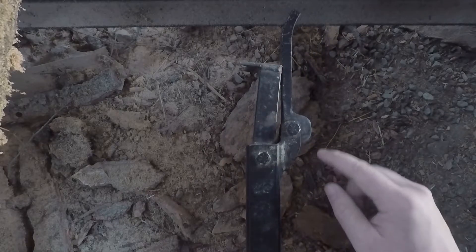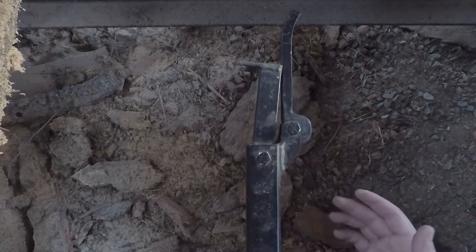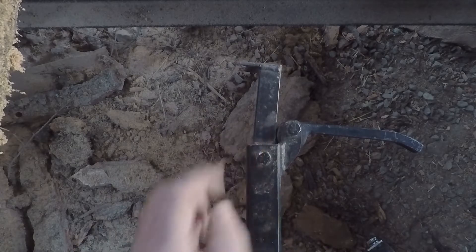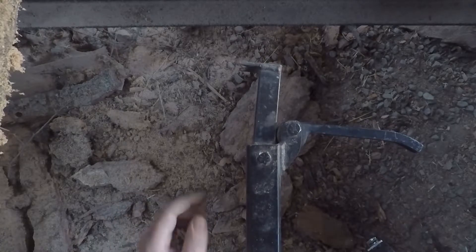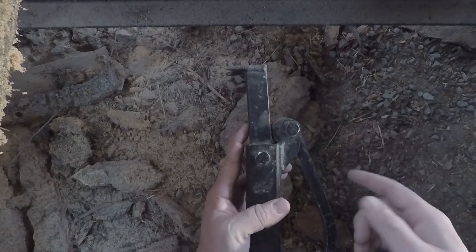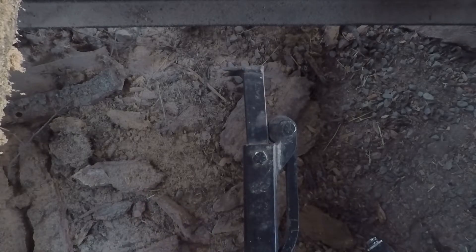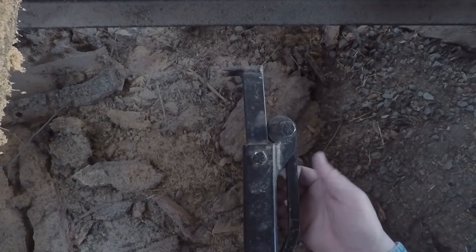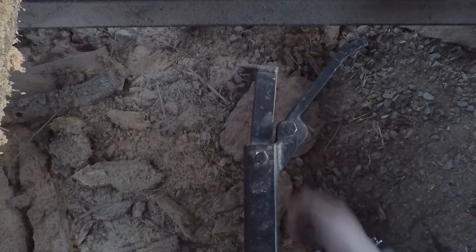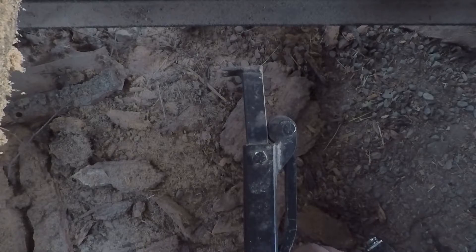I played around with the handle — I made the doughnut shape to begin with and then pivoted on pretty much a piece of paper to figure out what the shape looked like. There was some filing inside and shaping of the dog itself to allow it to pivot enough. As you can see, it goes around the round part, gets to the flat, and it locks in — it's essentially locked. One improvement I'd make is bringing the handle out a bit more, as it can be a little cumbersome to release when it's cinched in.